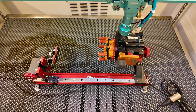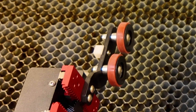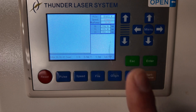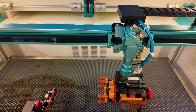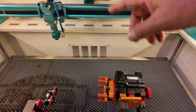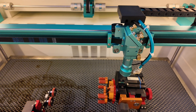I can see it nice and clear. I'm just going to follow that line and check it here on the back. I'm perfectly centered. Now, before I go any further, I'm going to move my head back over that center line and push the Origin button on my controller. The reason you want to push that Origin button is because you've already done the work to line up your axis parallel with your x-axis, so when you're putting your tumblers in and moving that head out of the way, you want to be able to get back to this reference point. A little tip: if you push the Escape key on your controller, it tells the laser to home the head back to the origin you just set.